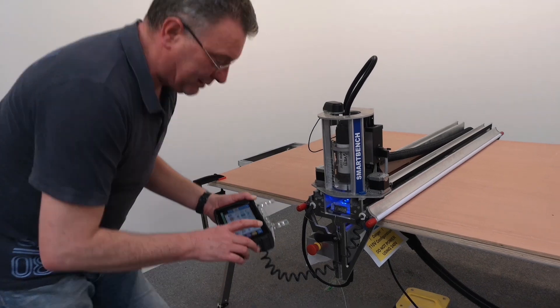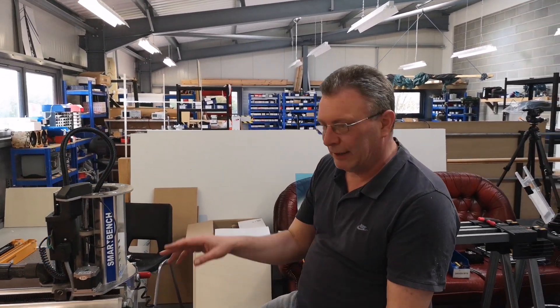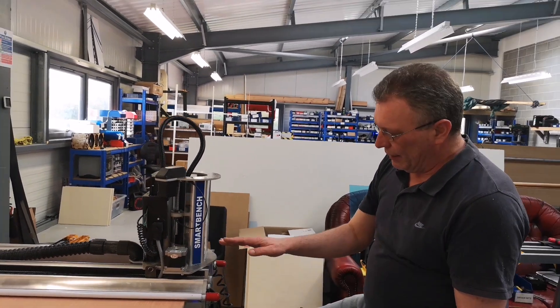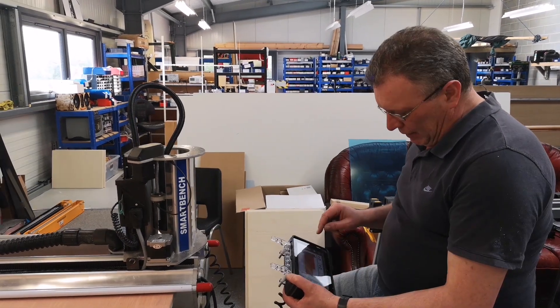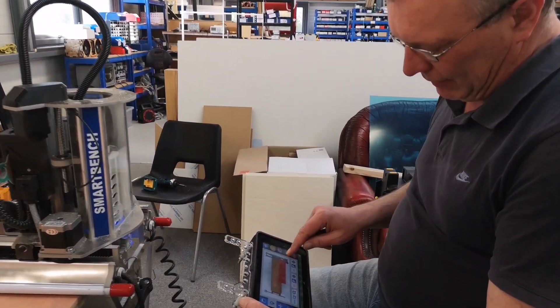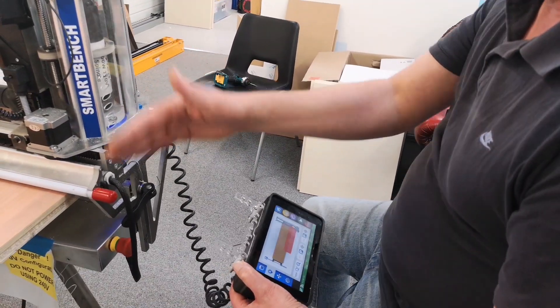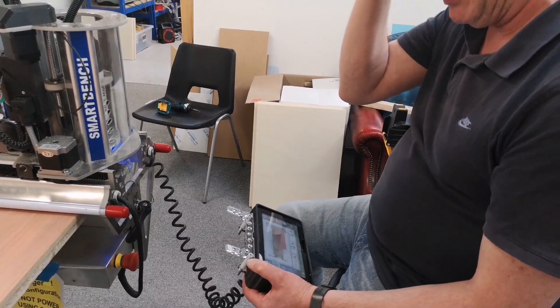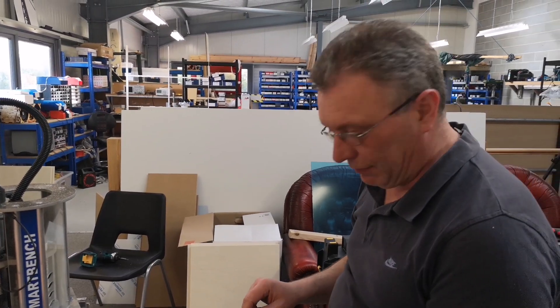Just make sure that all is good. Don't forget to tape your Z up — I've done that on many occasions. Set the Z height, we know our stock's in, we've got our X nice and locked down on top of the material. I've selected the file earlier and I'll just double-check on the visualization on the screen. There's our start point and there's our bounding box. If our geometry was outside of the machine's capabilities, EasyCut would tell you you can't process it and it wouldn't let you process it.